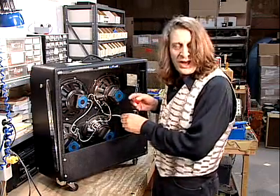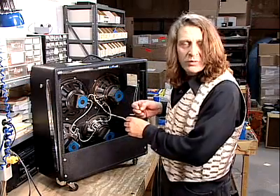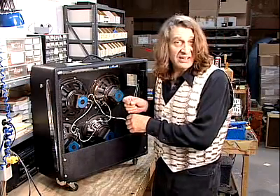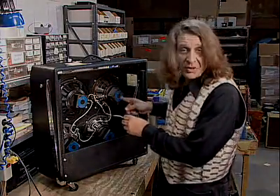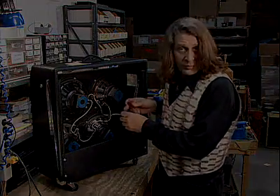All four of these were in phase. Had one been off, we would have simply reversed the leads feeding that particular speaker. Let's say, for instance, this speaker — when we perform the test, we put negative to negative, positive to positive.